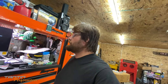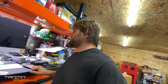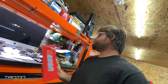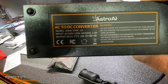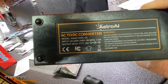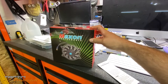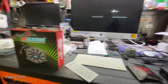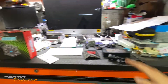I got Evil Energy AN tube fittings - the ferrule and the nut - so I've got those with one extra. Then I bought this Maxon seven-inch radiator fan in 12 volts. I ended up buying an AC-to-DC converter, 100-240 volts input, puts out 12-volt DC at 10 amps - that should be more than enough since the fan pulls about four amps continuously and up to eight to ten amps on startup. I plugged it in and tested it earlier - it does work and runs the fan.